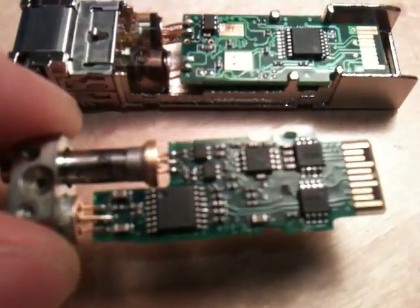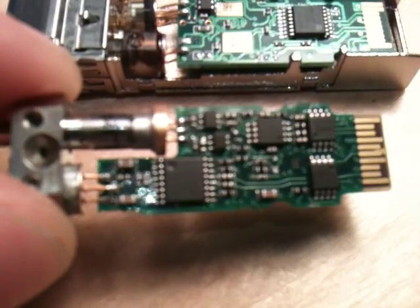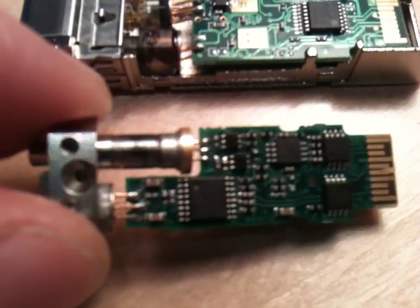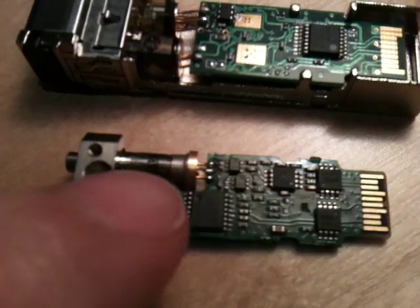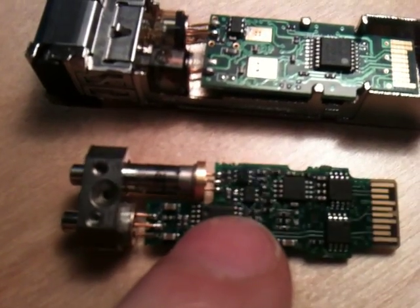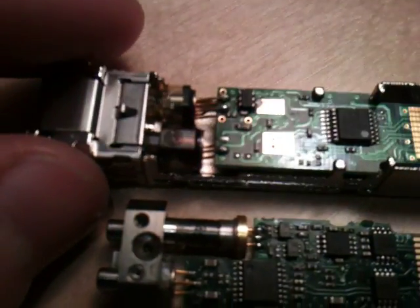This one here is the 155 megabit one that's completely useless to me, so I've stripped it right down. This is a 1310nm laser, and it's designed for single mode fibre. When connected to a 9 micron fibre, it should have a range of approximately 10 kilometres. And this one, when connected to a 50 micron fibre, should have a range of about 300 to 400 metres.